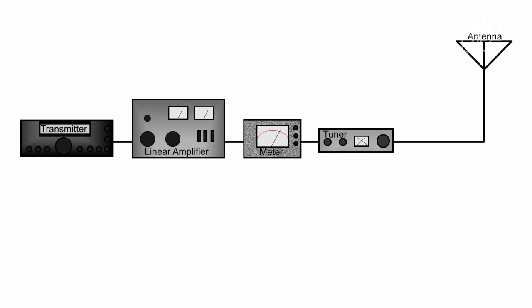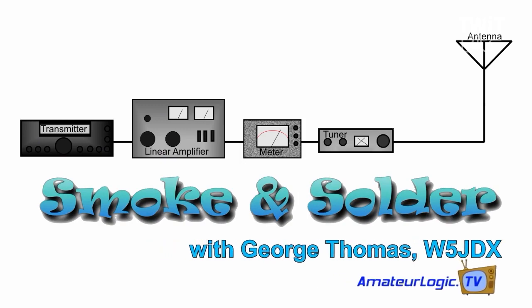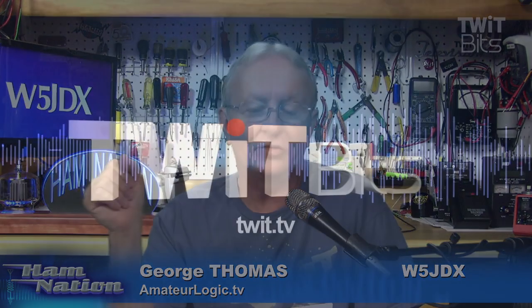Now, you can end up with some different cases and different gear, but typically this is how you'd do it. I thought it was about time maybe we talk about how you'd connect all those things together. If you're sitting there with several objects like that and coax, it can get a little confusing if you don't really reason it out. But the meter always goes right after whatever the output stage is, whether it's your transmitter or if you've got a linear amplifier. And then the tuner goes past all of that.